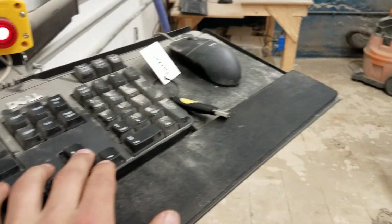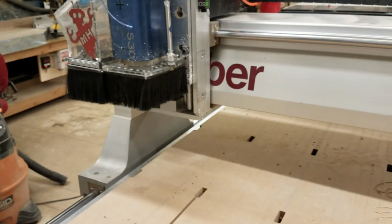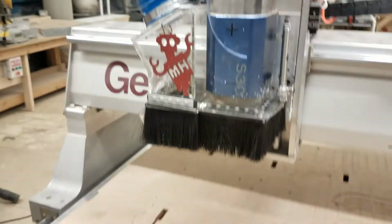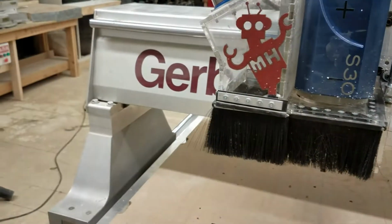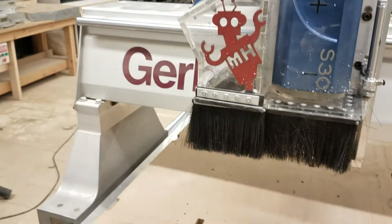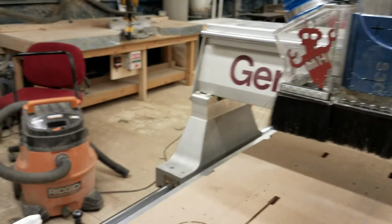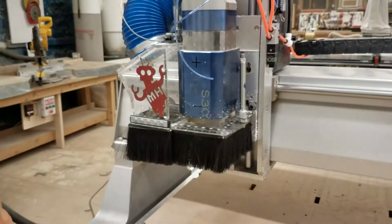At this point it's been homed, so if I hit shift up, it moves more quickly that way. I'm going to hit shift to the right, and I could go shift to the left, and it knows where it is, so it would stop in time without crashing into the left side, but it still would be a very abrupt stop. So you don't want to do that. You still want to approach the sides gently. So maybe you get close and then you approach it nice and slowly.